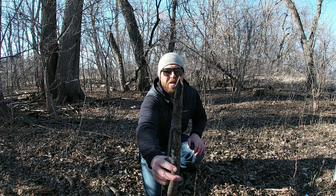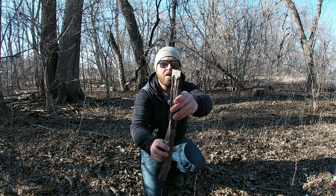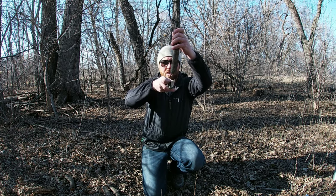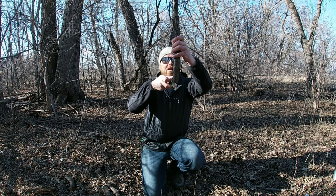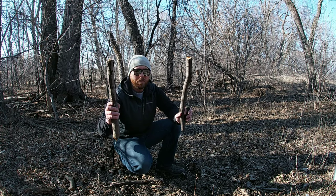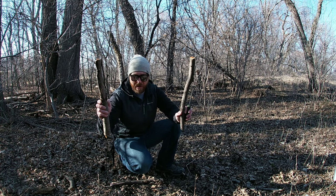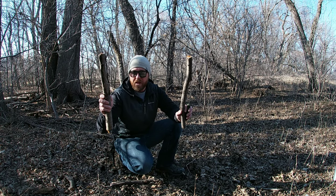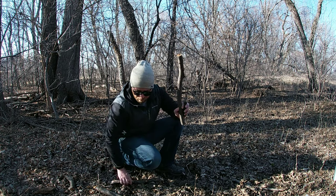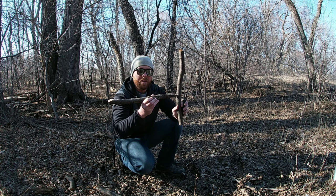See how I've formed a wedge? You're doing that on both sides. If you've got your wedge like that on this side, you have to do the same thing on this side — make your wedge at that point. So next, for your horizontal piece on your verticals, you're going to create a wedge seating — a female part where that male part of the wedge will marry up right with it. That will create a V, so your wedge point will sit right in there and lock in. Let's move to that next.